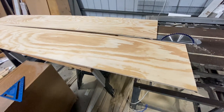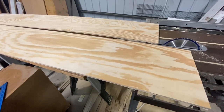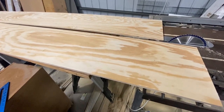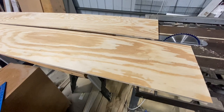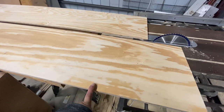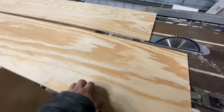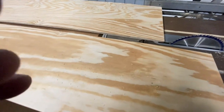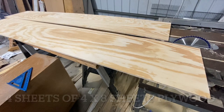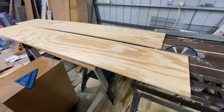For the last sheet — the back side — I actually used 1/2 inch. The other ones I used 5/8. That's because at the time they didn't have any 1/2 inch except for one sheet, and it was only a couple dollars more for the 5/8. But for the backing, to put it on the back side of the wall, I had to cut it to 15 and 7/8 inches instead of 16. That way all three sheets are 15 and 7/8, and it's going to take 4 sheets to make my breeding boxes. I'll have 3 sets of breeding boxes that have 4 nest boxes in each one.